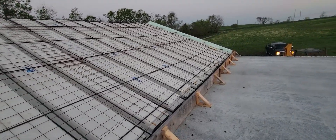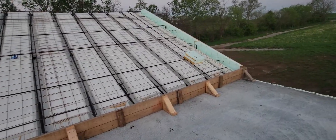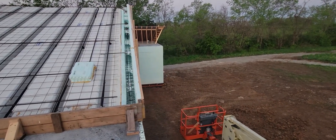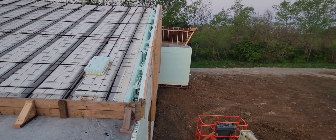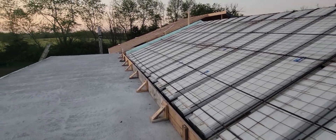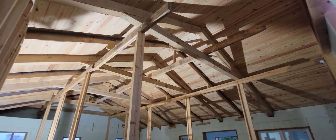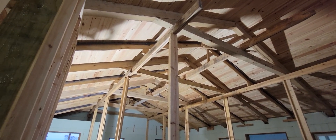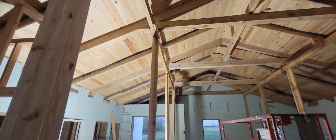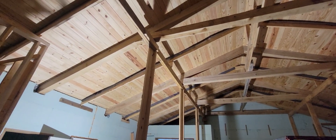We've got the chimney exit right out there for future use. As we get up to the front, we use the existing concrete as a brace for the front. From the inside, here's what the bracing looks like. We have two-by-eight running full length with two-by-six beams and T-posts running up to each one of those beams. Those support both the six-by-eight beams as well as the two-by-eight inner beams between those.